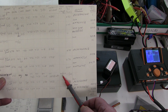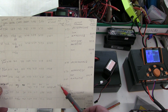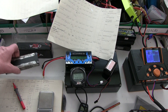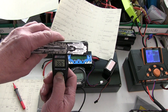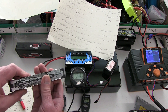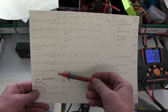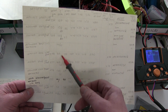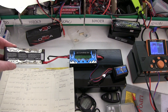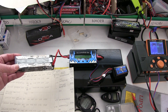I've got milliohm tests from the iCharger — it was 2.0 milliohms on each cell during charge at 10 amps. The temperature — I didn't check it during discharge, but these cells never really get very hot, normally in the 30-degree range, around 32.6 degrees, which you'd expect from all these new low-internal-resistance batteries. So it looks like it's the same as all the others. I don't know whether all the manufacturers have used the same cells in different cases, but they all test to very similar capacities. The Orca LCG HV 6,300 mAh generation 3, 110C discharge rate.